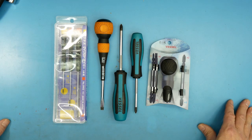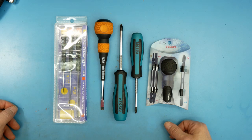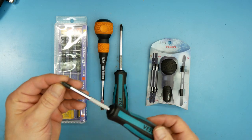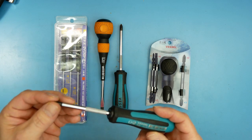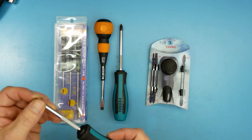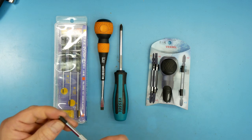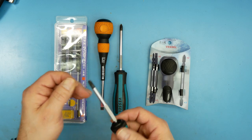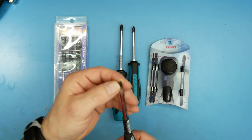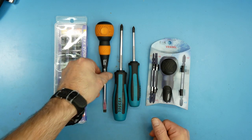The reason I've taken so long to review is because they're screwdrivers — such a simple tool. You can pick something up and like it or dislike it at first, but after using it a while your opinion may change. With screwdrivers especially, unless they fail instantly, it's hard to know if the tips will last. On flat tips, the corners can roll over and you won't notice until you put some extreme torque on them.